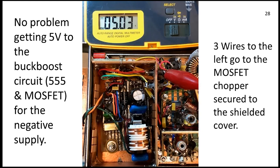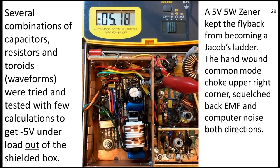There it is — you can see the negative five volts measurement there. Notice the former white common-mode choke is now wired as a flyback transformer. A strip of iron was glued to the secondary to get voltage slightly above negative five volts — the meter showed negative 4.9 which annoyed me, so I super-glued a piece of iron on the end and it came up to 5.18. Five negative 5.18 as opposed to five volts. We used to say in the TWA business: it ain't no piano — at some point you have to say it's close enough.